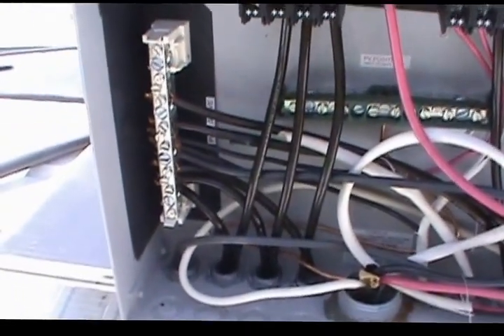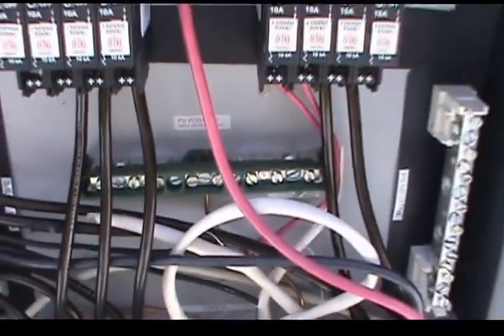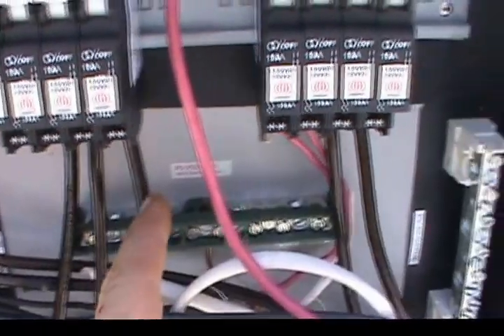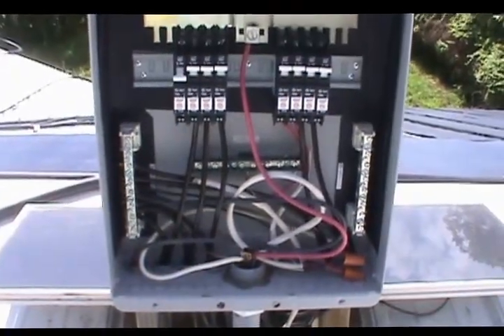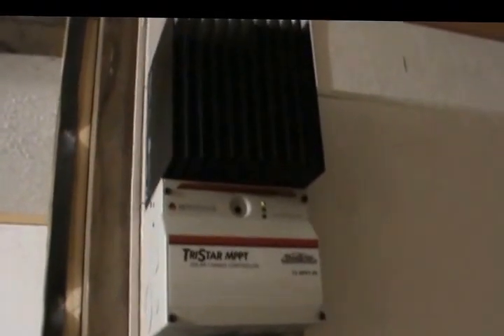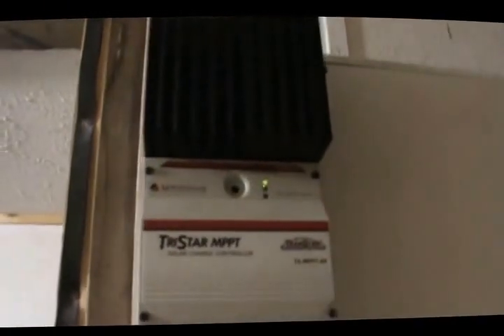With the final cover removed, you can see all the negatives joined together in that bar. All the positives run through the breakers, coming in from the panel groups here and out the top to these bars, combining into this eight-gauge wire going inside. That's running roughly between 80 and 90 volts when producing power. The lines coming from the roof then go through this disconnect for safety and serviceability. Thanks to this MPPT charge controller, it converts that 80 or 90 volts to the appropriate voltage to charge my 48-volt battery bank, then goes through another disconnect — this one with fuses — and out to the batteries.